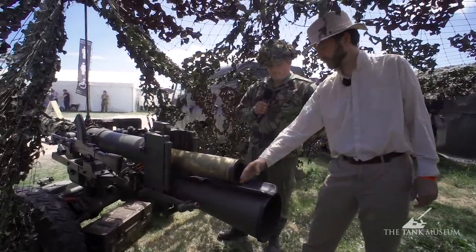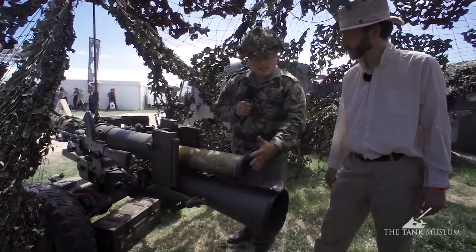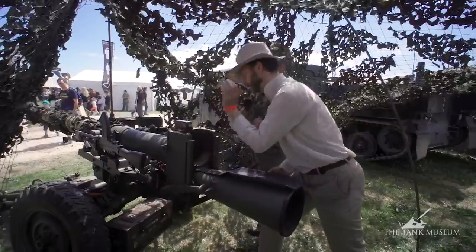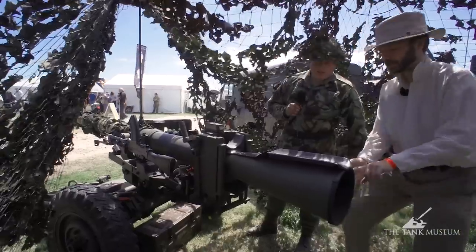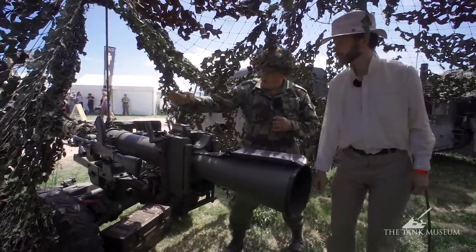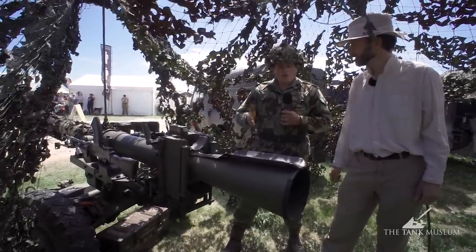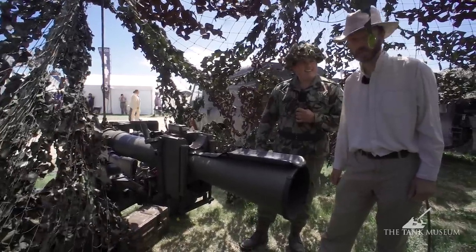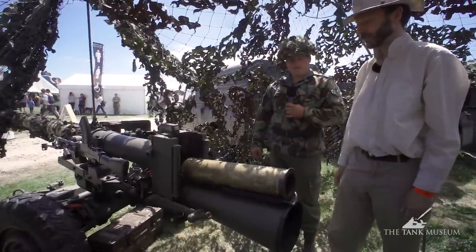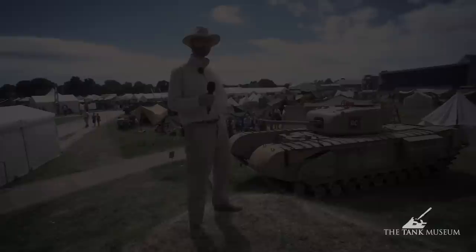Here at the breech end is this big fat tube where all the bad news comes out the back — the venturi. This fired shell originally had a bakelite blasting disc in the back which came out when fired, holding a percentage of the energy. To load: push the round in with the flat of the hand all the way, close it with the levers. The number one gunner fires the Bren, sees the tracer hit, then hits the electronic fire button — the signal goes through the solenoids, sending a pin into the casing. Big bang — about 120 decibels, same as a jumbo jet overhead, which is why most old gunners who fired this are deaf as a doornail. Then pull the casing out — normally with asbestos gloves as it's scorching hot — and load the next round.